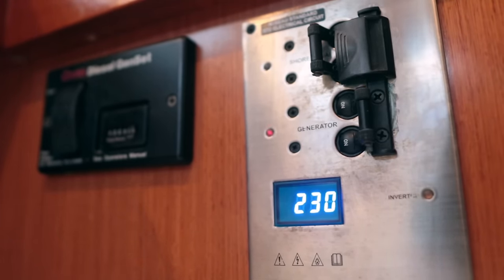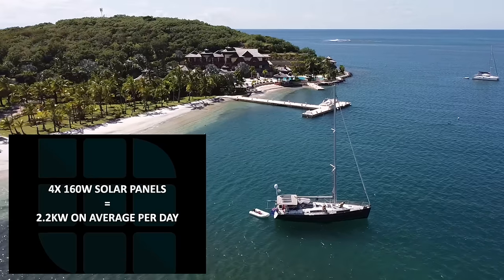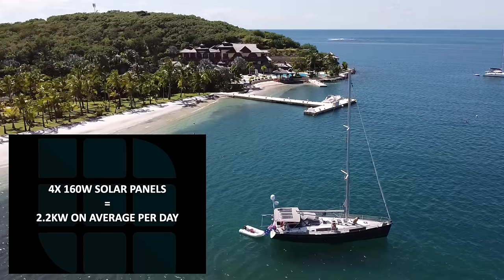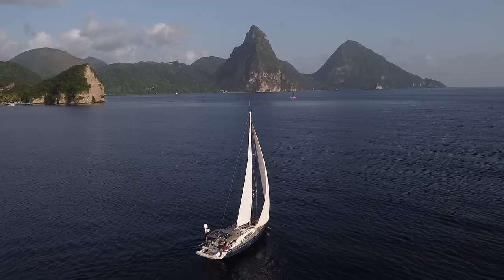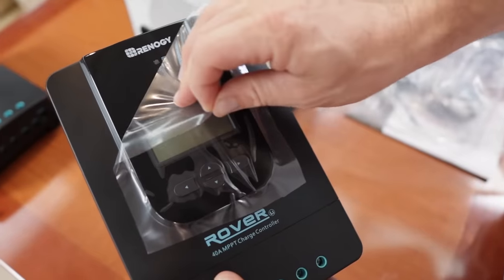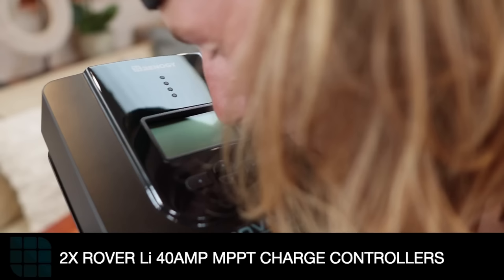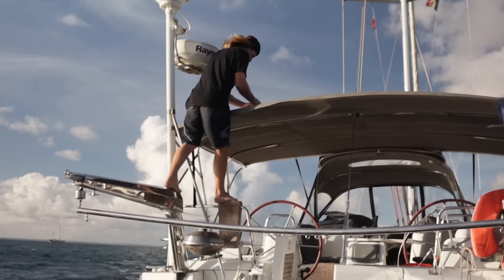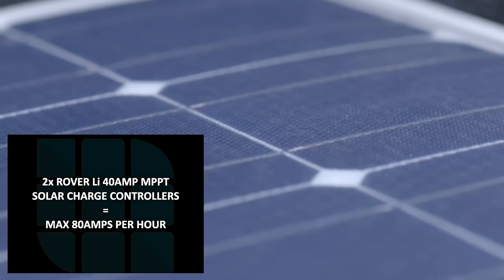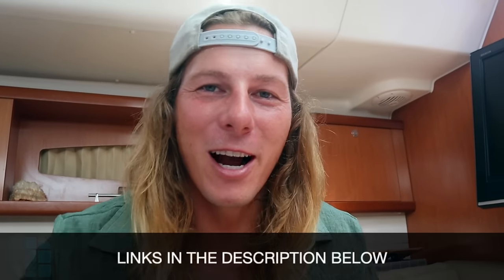To be honest, we predominantly get all our charge from our 640 watts of solar panels up on our bimini. We produce on average 2.2 kilowatts of electricity per day, and we've generated over 2,500 kilowatt hours from the sun on our journey so far. To convert the sun's energy to charge our lithium batteries, we need what's called an MPPT solar charge controller. We have two Renogy 40 amp charge controllers — between the two, we could potentially charge up to 80 amps per hour from the sun, but right now we charge at about 40 amps per hour.